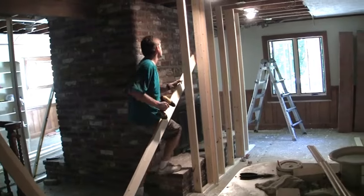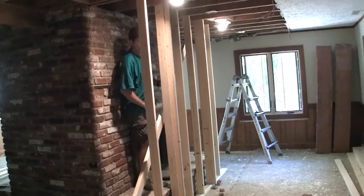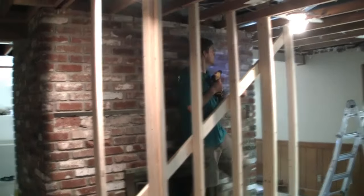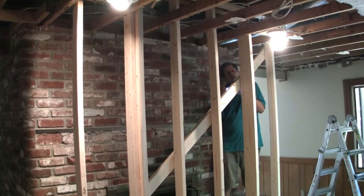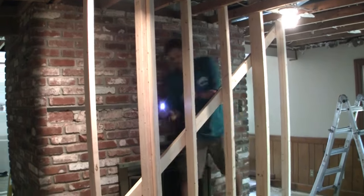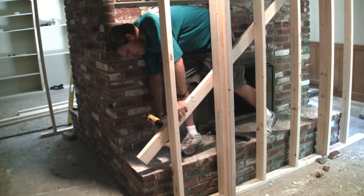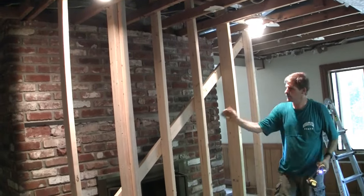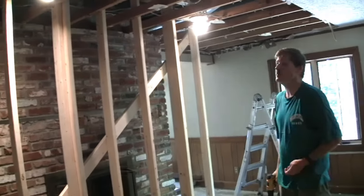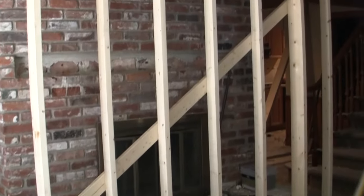To really complete this wall, we're going to add a cross brace to it. The purpose of this is just to make the wall completely rigid — there'll be no flex in it whatsoever. This will make this wall absolutely rock solid. When you're below the weight that's above us, it's really nice to have that extra peace of mind. That right there is a pretty sturdy wall. So we are ready to take the chimney down. And here's our fully supported temporary wall.